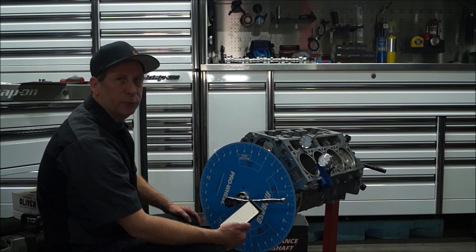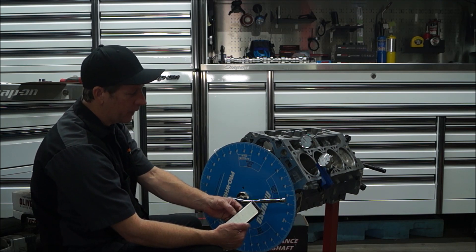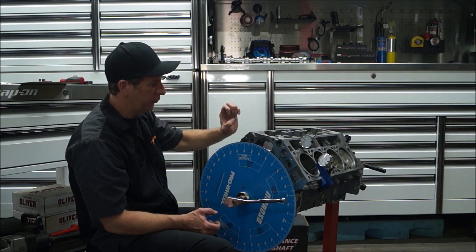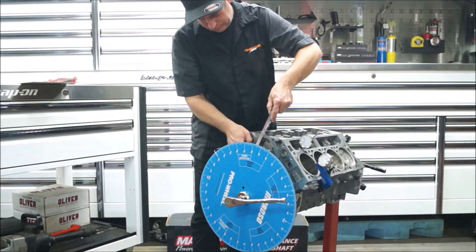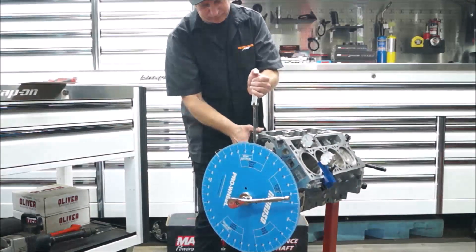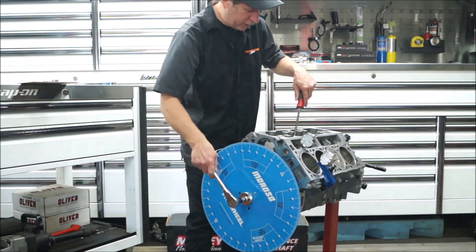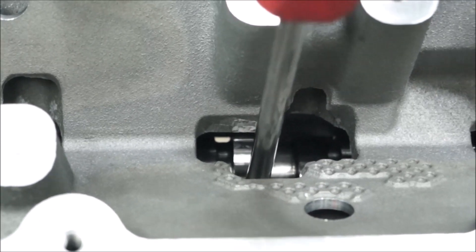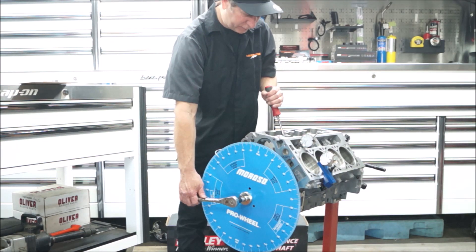105 is advanced pretty far. These motors do love to be advanced, but 105 is an overshoot for us. I am going to try to get closer to 107.5 to 108.5 max. So what we will do is loosen up the camshaft and see if we have enough slack in the stock gears to retard that camshaft a few degrees. I can advance the crankshaft, which will hold the camshaft steady, which should retard the camshaft if we have no slack.